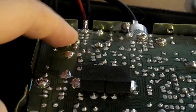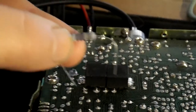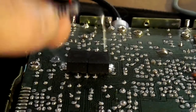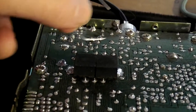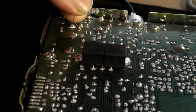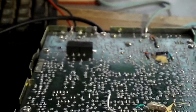Basically, all you're going to do is take a resistor — this 100-ohm resistor rated at 1 watt — and you would just place it right there between those two solder joints. You would clip the leads; you wouldn't leave it hanging. Just put it right there between those two solder joints, and that would give you a talkback. I'm going to go ahead and test that out right now and show you.